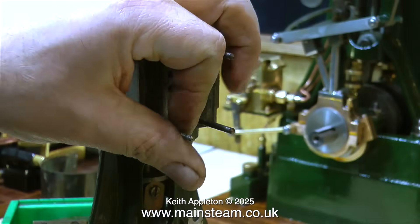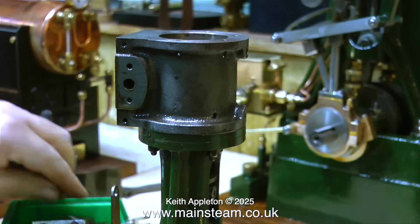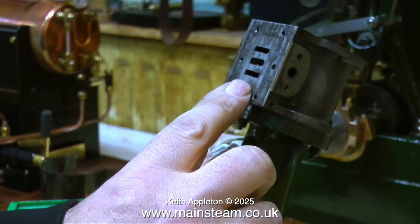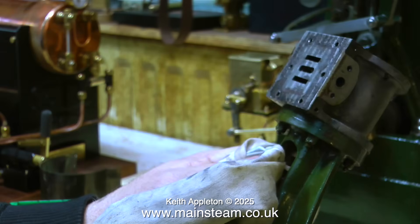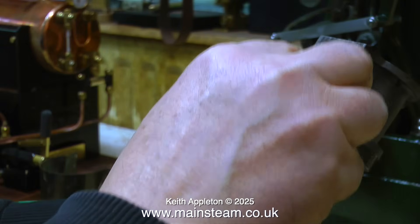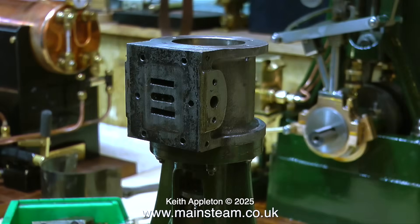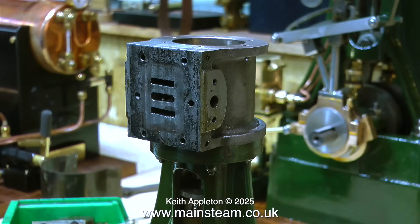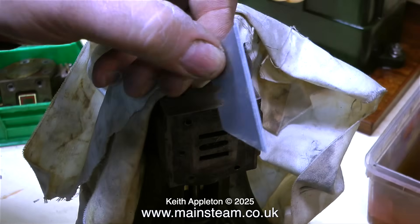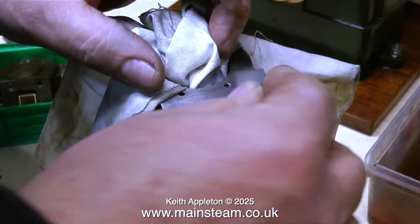With the help of a pair of pliers and once again being very gentle so I don't mark the parts, I'm removing the studs that hold the steam chest to the main cylinder block. What's the port face like? Well it's just as it was machined - it's not been ground down at all, but to be fair the valve doesn't blow, so it's great. I'm not going to do anything I don't need to do with this engine. I haven't come across any gaskets, but to prevent any leaks when I put it back together I will be making some new gaskets. This varnish is going to be difficult to remove - I don't know what it was originally, but it's very tenacious stuff and just not very good as a barrier against water.